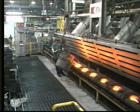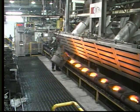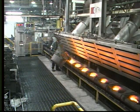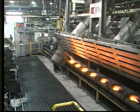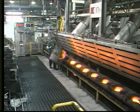Two pouring modes are standard with this system. Mode one: molds are poured at rest as they index through the designated pouring position. The index may be initiated by the pourer or by a timer set by the pourer.